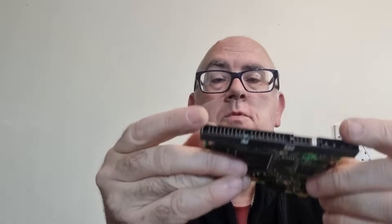As a quick review: chips, MLCCs, any gold-flash connectors, and gold pins — that's what I'll be looking for and removing from hard drives. The MLCCs are another way of collecting material that can be processed later for silver and platinum. The older MLCCs would have a certain amount of platinum and silver; newer ones have silver but less of it, and very few new ones have platinum anymore. Platinum is more an industrial precious metal used in computing rather than in jewelry or investment bars.